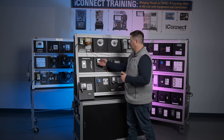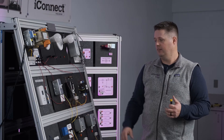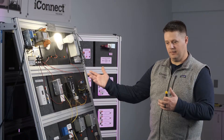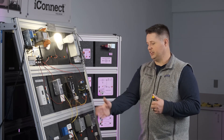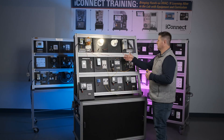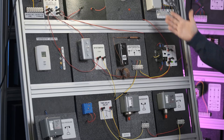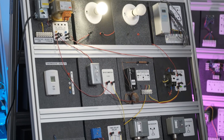As we turn this on, nothing happens at first because we're waiting for the time delay. The time delay finishes, all the rest of the components are closed, the contactor pulls in. That second circuit then has a complete path from the transformer through the contacts, through the light bulb, back to common.